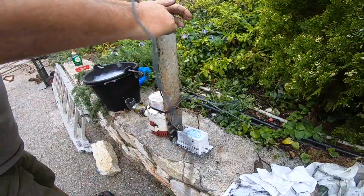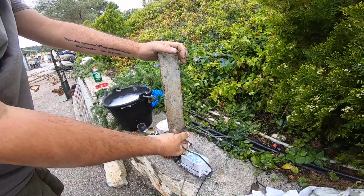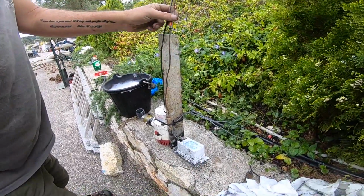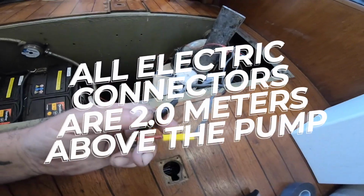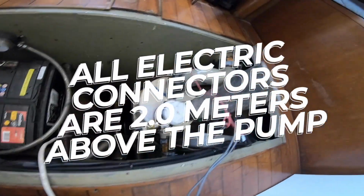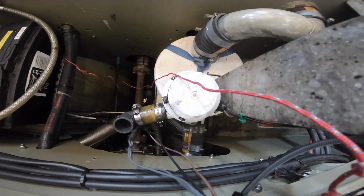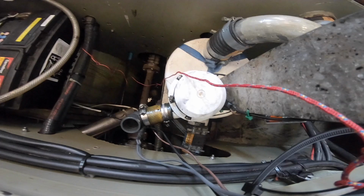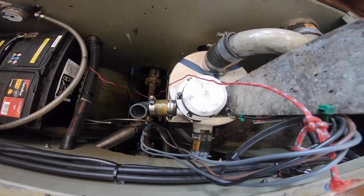the aluminium bracket, so the wiring will get cable tied to that to keep it up out of the way. And then we're almost ready to reinstall. Just trying to waterproof the connections with self-amalgamating tape. So the pump's ready to be dropped back in. Okay, off. I'll just do that one more time. Okay, pump is definitely rotating, so we've definitely got the pump working.